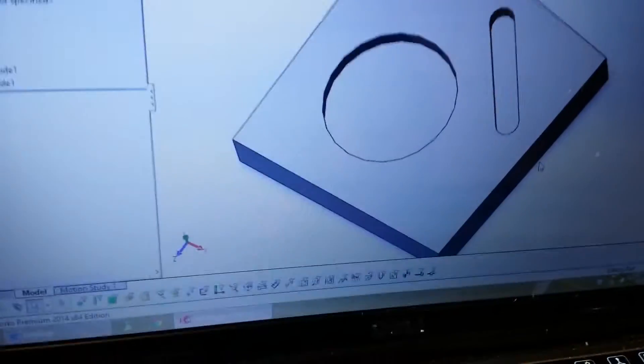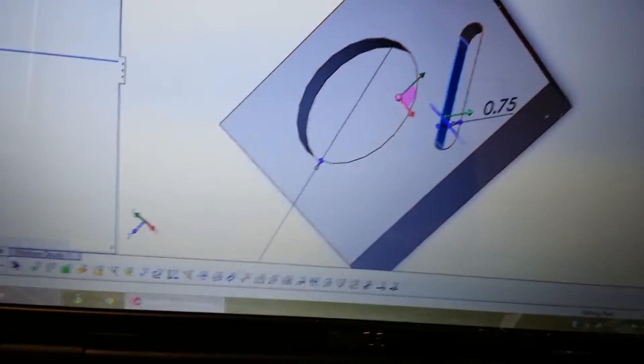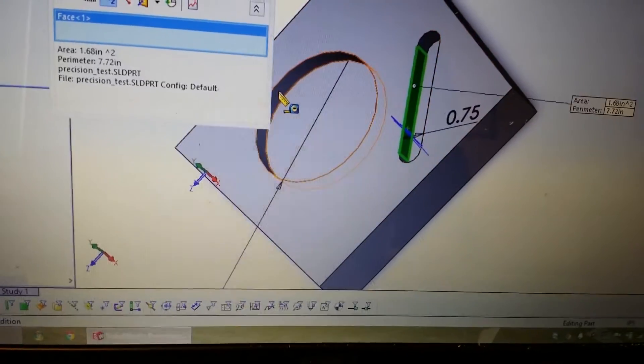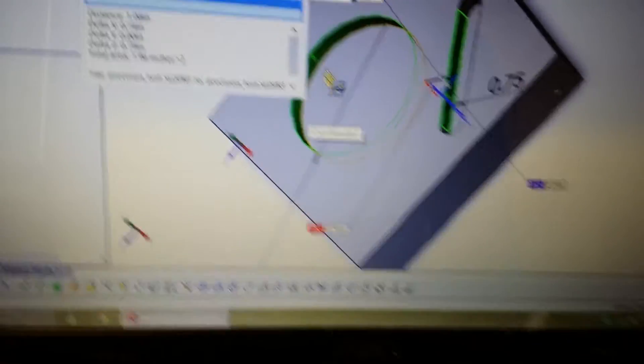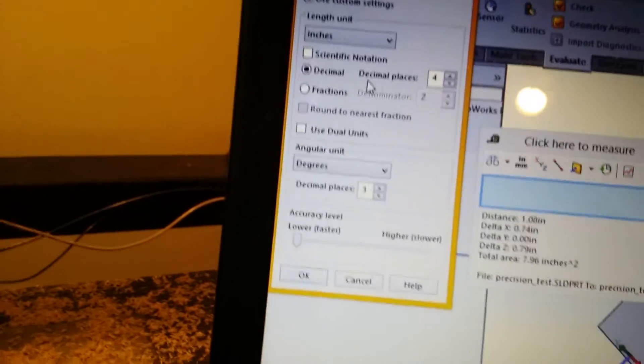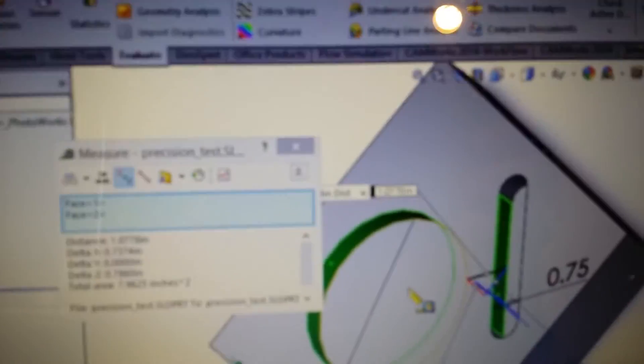I tried to highlight it when I was cutting on Mach 3 — Mach 3 wasn't telling it to cut a full circle on this end here. But with a few more measurements, we can find the distance between the two shapes. Minimum distance is 1.08. Let's increase the tolerance here a little bit. There we have 1.0778, if you can read that — there we go.